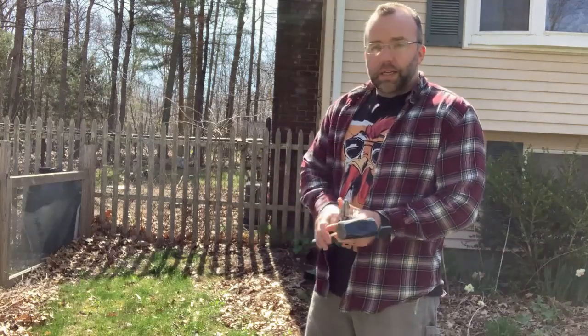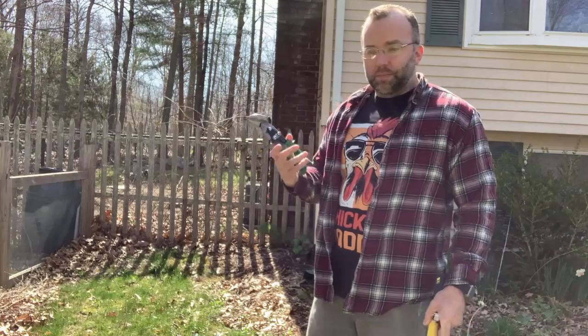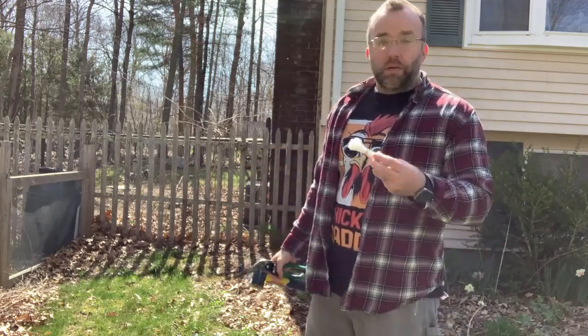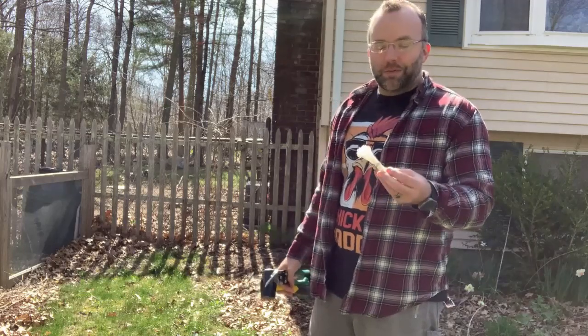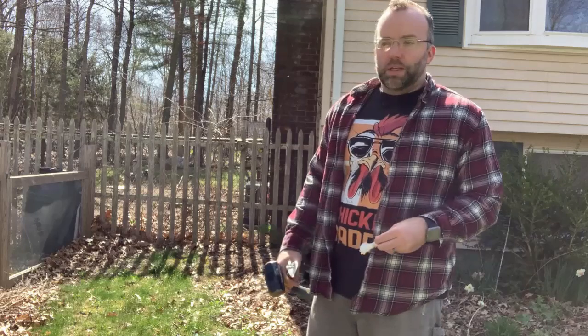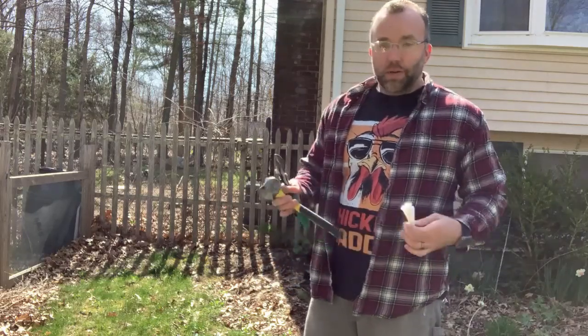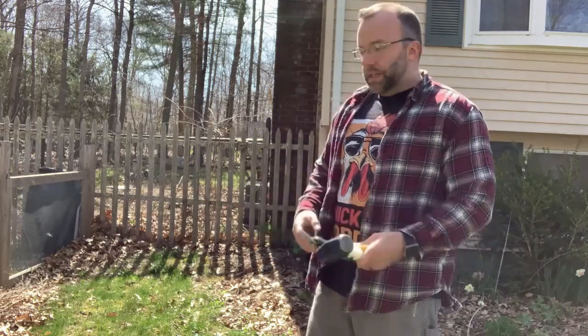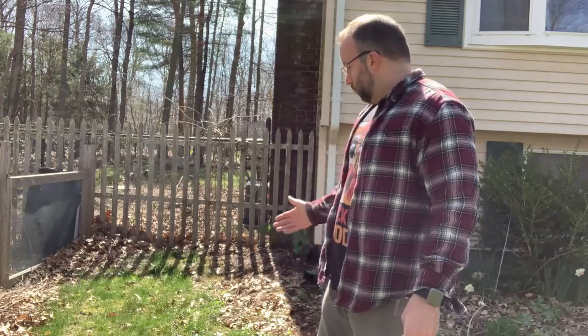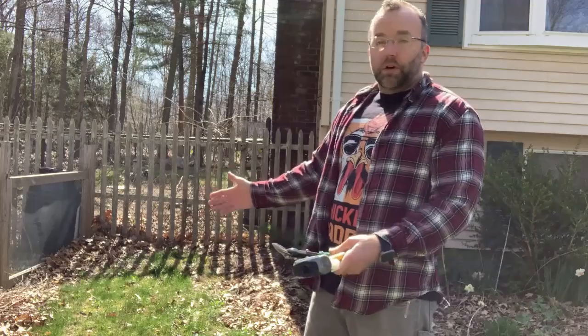We're also using tin snips to cut the fencing, and we are also going to use zip ties. It's one of our favorite things to use here. Makes your life really easy when you're doing the fencing or the cattle panels. Really holds things together well. And we are using 6-foot T-posts, and that should work really well with our 5-foot tall fencing.